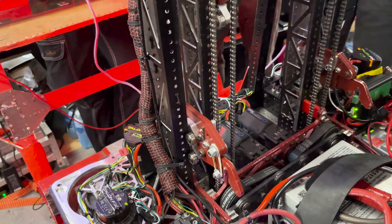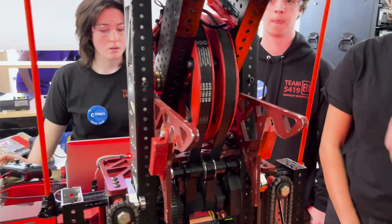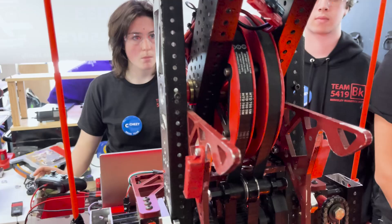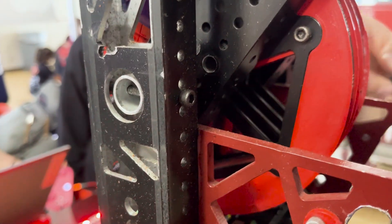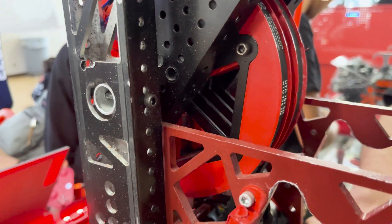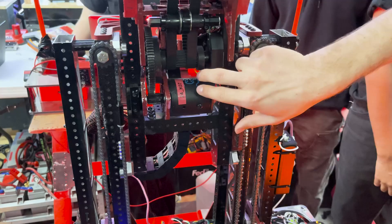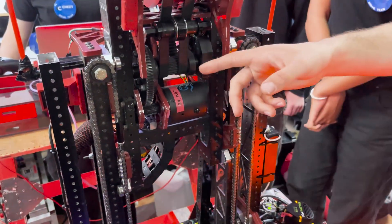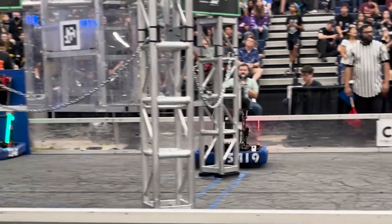The large pulleys are standard PLA, 3D printed along the long axis for maximum strength. The insides have CNC aluminum plate inserts inset into them for rigidity. The center pulley is carbon fiber to handle the torque — it's a small pulley on this ratio turning a pretty heavy arm, so carbon fiber ensures it won't shear. The larger-radius pulleys are just basic PLA because the radius is big enough that shearing isn't a concern, and we have not experienced problems with that.